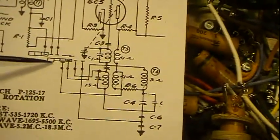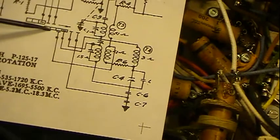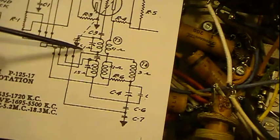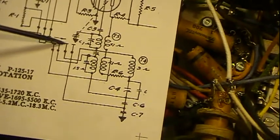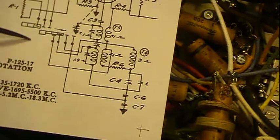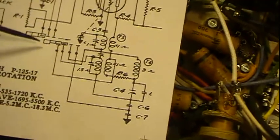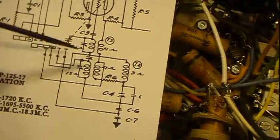So anyway, that pretty much deals with how this switch is working. As you rotate it through, all it's doing is moving this over, and you can start counting out the connections where it hooks to. You find your common, locate it and where it hooks, and then you just imagine it or draw it in. The next position will be just these two contacts, and the next position all four come in. You start locating one, locate the next one, and then it's easy to start following. This one here particularly, one of them is shorter than the other three, so it's easy to find, and so on.